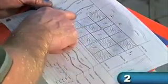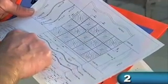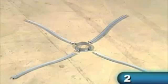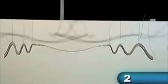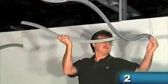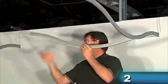Before installing the cross tees, review the 2D ceiling plan to determine the location of any utility circles that will be installed at cross tee intersections. Utility circles and their intersecting cross tees are assembled separately and will be addressed in the next video segment. For now, we'll focus on standard cross tees. Begin with a 4-foot cross tee. Insert the end of the cross tee into the appropriate slot in each main tee.